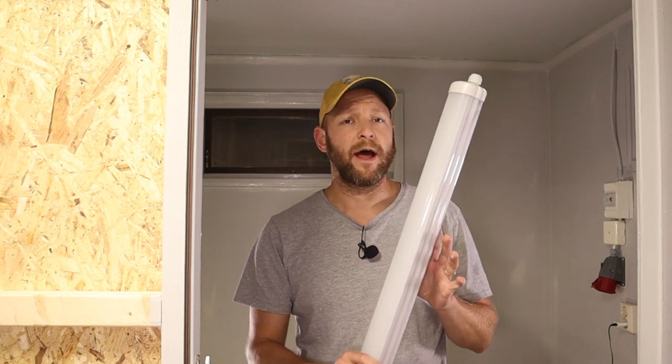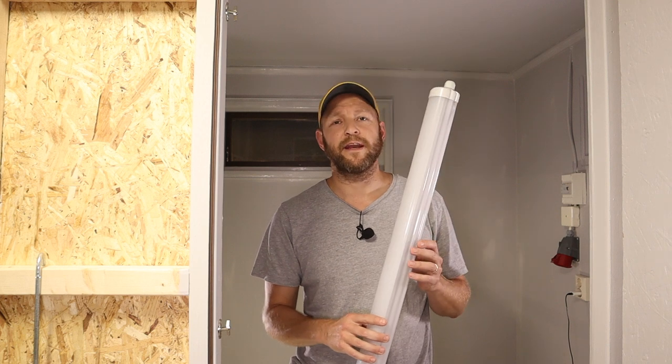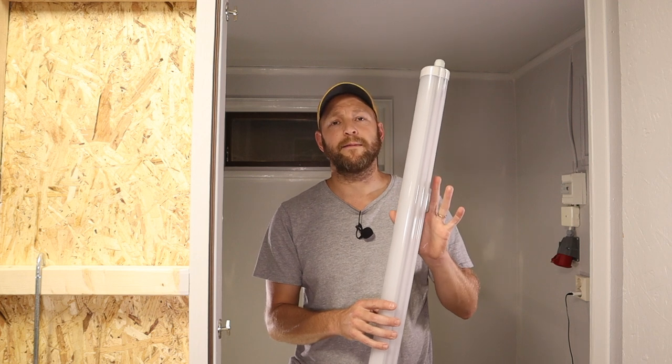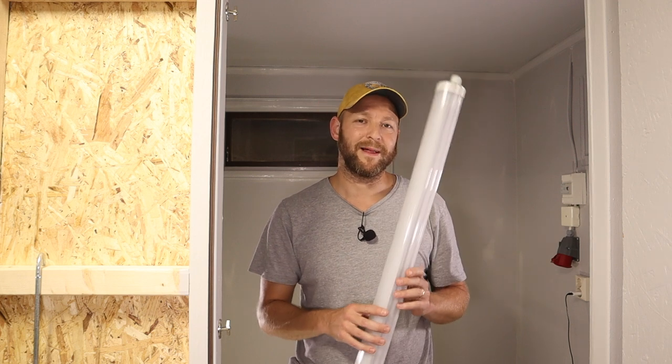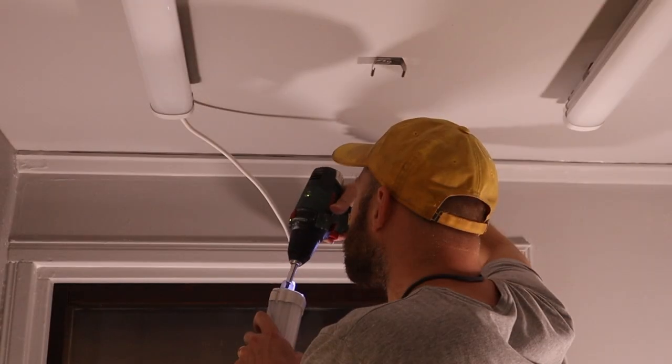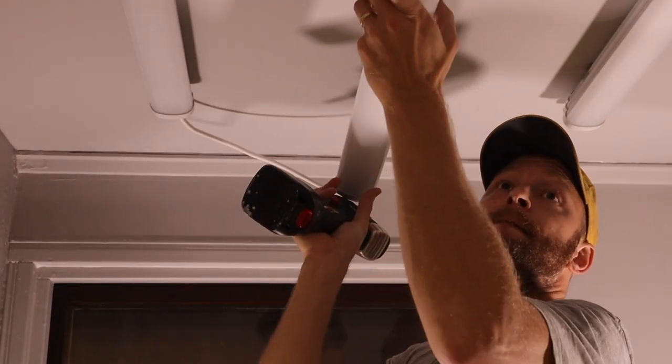The lights in the paint booth are very important, both to get the right amount of light as well as the right light temperature — but they are also a source of danger. The fixtures I have chosen are waterproof, which is not the same thing as explosion proof. However, I will be painting in very short sessions and it's a well-ventilated area, so the risk is very small. I installed four fixtures with a total of 11,520 lumen and a light temperature of 6,000 Kelvin, which is very close to daylight.